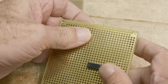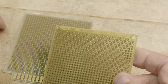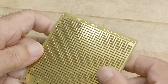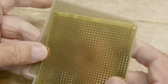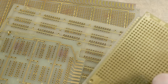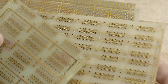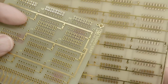That is an interesting board. That one has a different part number: 5021-5314. These boards are so close to each other — this one doesn't even have a number. It's interesting, it also sort of shows you the age of these boards. FR4 material — as somebody correctly pointed out, it stands for fire-resistant fiberglass. You can see these boards have a kind of greenish, tannish, greenish tint — that's FR4 material, and it's quite hard.